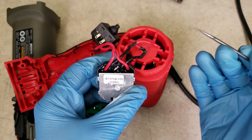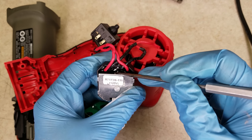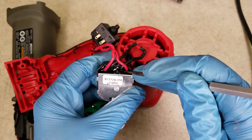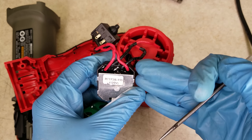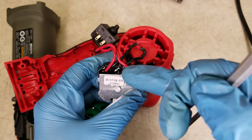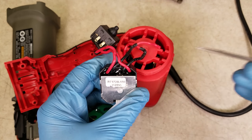It's a little bit hard to see in here, but if you look down in there it's all black, and that's because the speed controller has been filled with epoxy. That helps reinforce the physical connections and also helps keep moisture and contamination from getting in there. This is a nice detail, and it's also included on the old one.